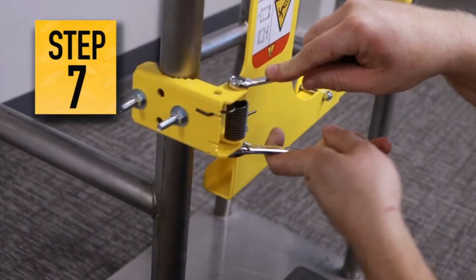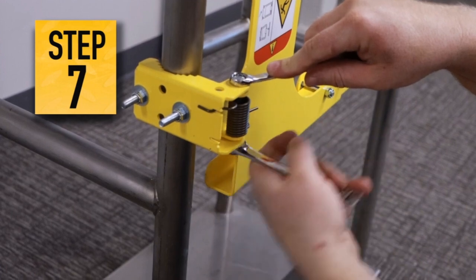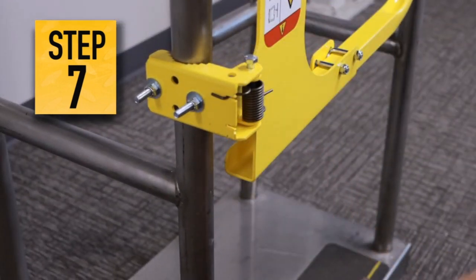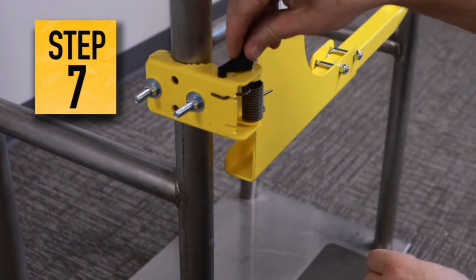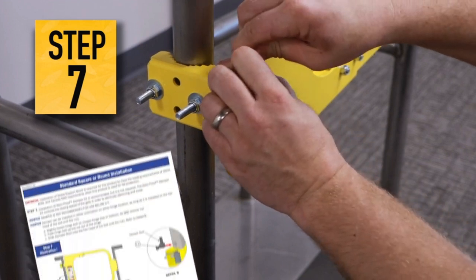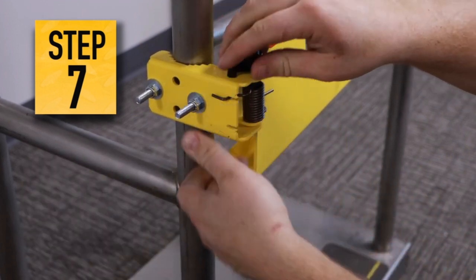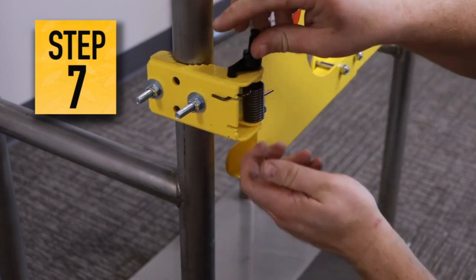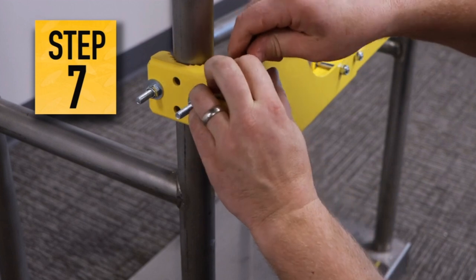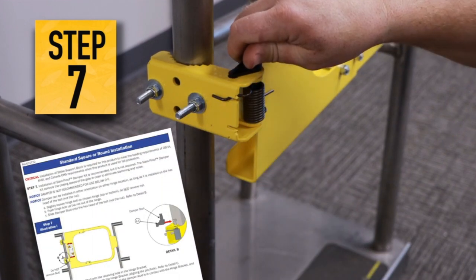First, slightly loosen the hinge bolt on the chosen hinge, either the top or bottom. Do not remove the nut. Then push the hinge bolt up, but not out of the hinge. Next, slide the damper stud onto the hex head of the bolt, not the nut. Refer to the detail in the manual. Now, align the damper stud with the receiving hole in the hinge bracket. Next, push the damper stud flush with the hinge bracket, aligning the pin/hole. Refer to the detail in the manual.